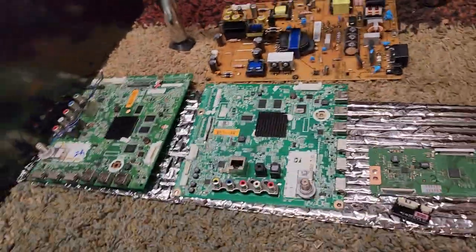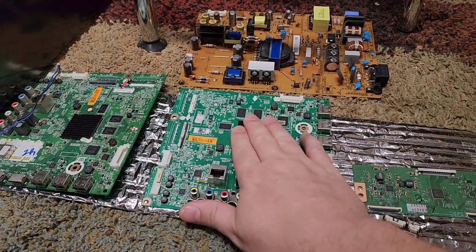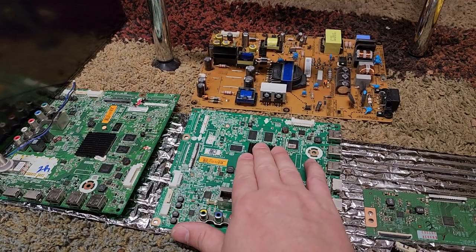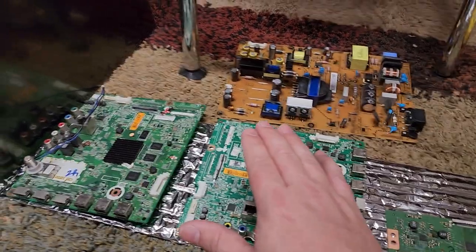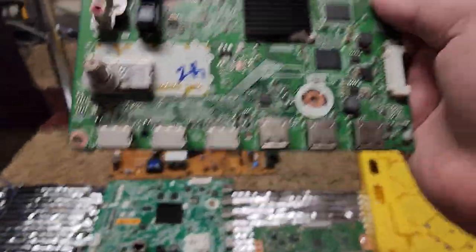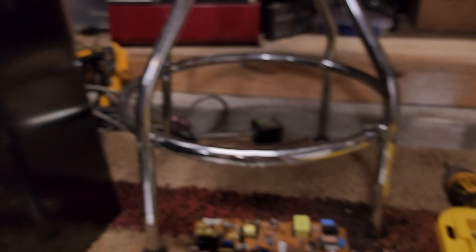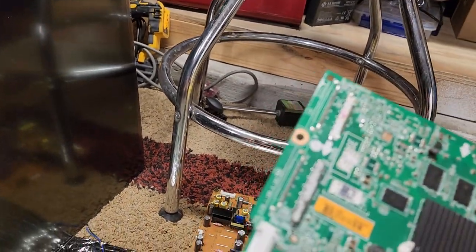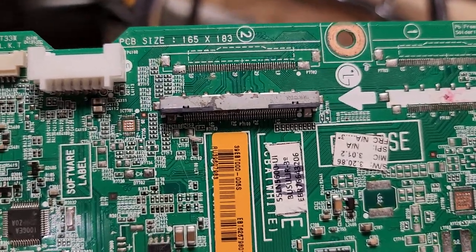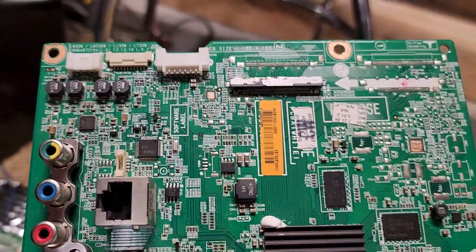One of the reasons I bought extra boards: initially the board I originally had was getting really hot while in standby power — so hot I couldn't even touch it. That is almost a direct indicator that something is not right. So I went and bought one off eBay. One of them has a lot of — you can see some of the corrosion right here. Take a look at some of those tracks — there are corroded components on this board.